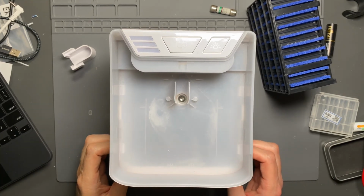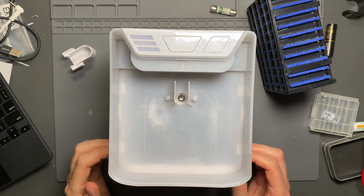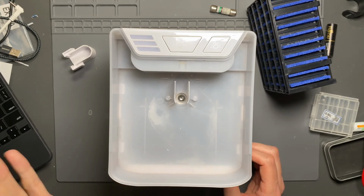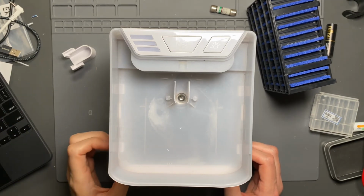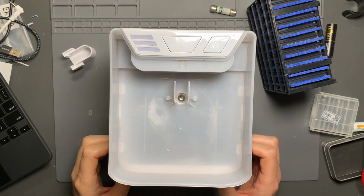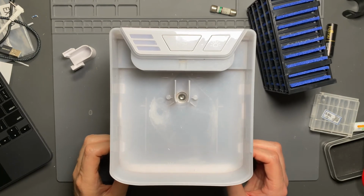It's so easy to get mold and mildew, just like you would see in a cold mist humidifier that uses a filter like that. That's not to say don't use cold mist humidifiers. I've used them before and they're fine. I don't use ones that have a variable humidistat. I just let it run until it's empty, dry the filter out, refill it, that sort of thing. And generally, as long as that filter has air flowing across it, it minimizes mold and mildew buildup.